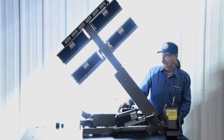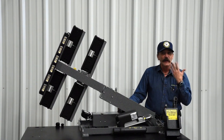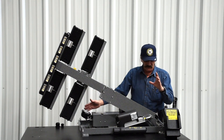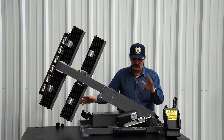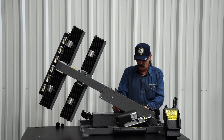That's also how you will set it. So as this is coming down, this is what we would call our tomahawk right here. If that safety mercury switch was not preventing it, it would drive those lamps right in. This is a 1,500 pound actuator — not much of a battle here. This one will definitely win. The lamps will get broken off. That's the reason for the safety limit in there.